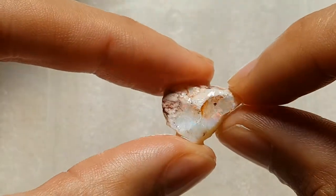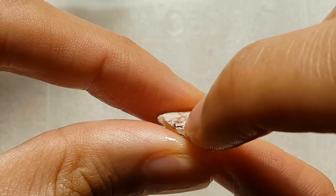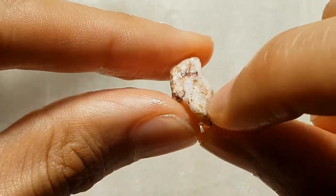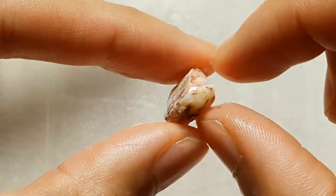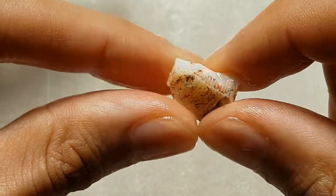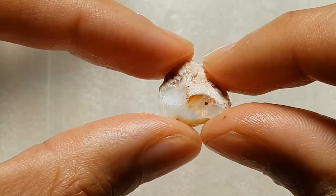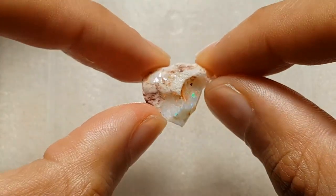We've set out the game plan and we're going to go for it. So diamond bit, only for a tiny bit. We're just going to take off that ugly outer crust with the diamond, and then switch straight to Novas. We'll shape it with the diamond a little bit around the edges, take off that tiny bit of outer crust, and might just scrape off the bottom because we've got a lot of thickness there. But apart from that, it's going to be Nova tips, and they're going to give this a nice shine, and then finish it off with cerium oxide, as long as there's no sand that destroys the whole stone. But I'm not expecting there to be a lot of sand in this one. I'm expecting this one to be pretty good, which means there's going to be a lot of sand. So wish me luck. Let's get to carving.